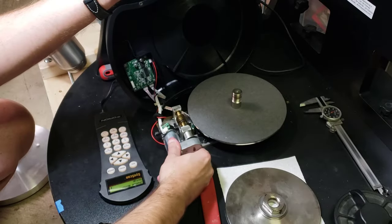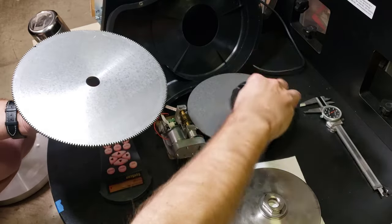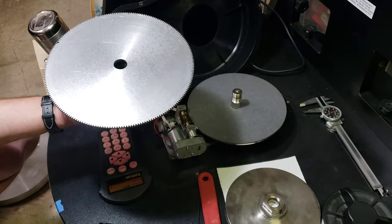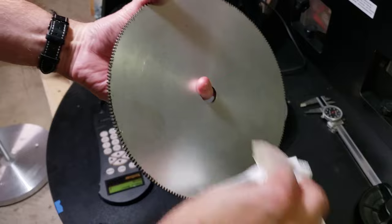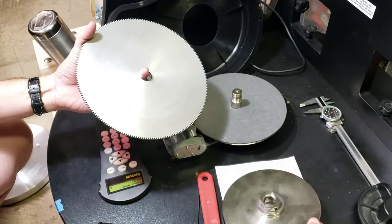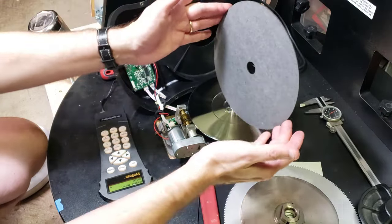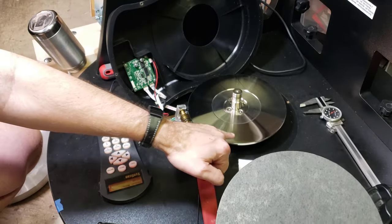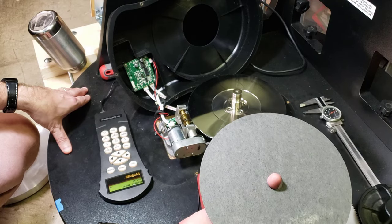This little motor is spring loaded. And this is like a felt disc — this is the clutch. When you tighten this down, it smashes everything together, and when you loosen that, it allows you to spin this by hand. This is a very clean disc. I'm going to make sure I put everything back in order. I'm being very careful not to drop this because I don't want to screw up the gears, and I don't want to get any oil on the bearing surface here. Let's take this disc off and see what we get — that's just literally like a felt card. So this works just like a clutch in a car: you've got these two steel plates squishing this bearing surface, which is just felt. That allows it to slide over it very nicely.